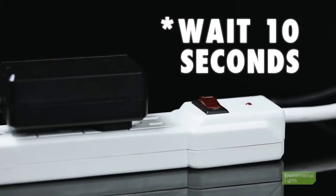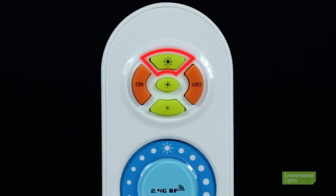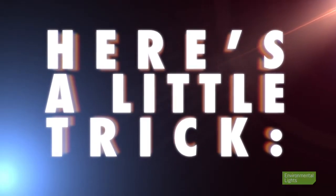To sync the remote to our controllers, first disconnect power for at least 10 seconds. Then in a moment, we're going to reapply the power and press the brightness increase button shortly thereafter. The timing of reapplying power to the lights and pressing the brightness button can be super sensitive and is oftentimes tricky. Fortunately, I've got a little trick up my sleeve that will save you a lot of time and effort.